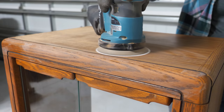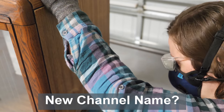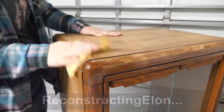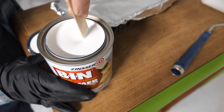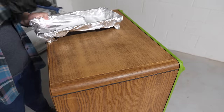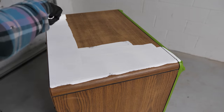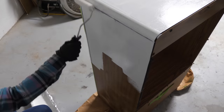At some point while working on this cabinet I decided it was going to be a spaceship. So I started prepping it for intergalactic travel by first sanding the substrate with 150 grit sandpaper. We need to ensure a good seal coat on the carcass of this ship, so I used Zinsser BIN shellac primer, applying two coats with a roller and sanding down the last coat so everything was smooth. I did ask my local Ace Hardware if they would tint the primer but they noted they can only tint the water-based version.